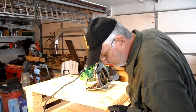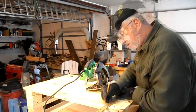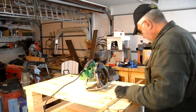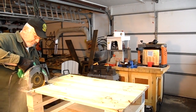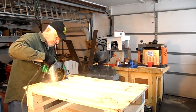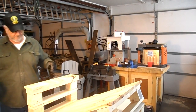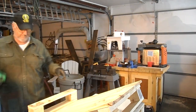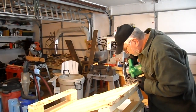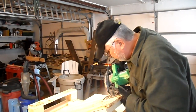In this process, instead of actually prying these boards off, I go through the process of marking a line and cutting the boards, because these are pines, and a lot of times when you start prying on them, you're going to split them. That's why I chose to sacrifice about four inches on each end. I score a line to miss all the nails, and just use my circular saw here to do that.